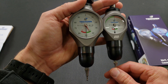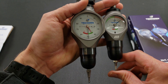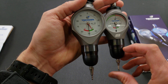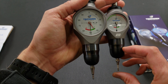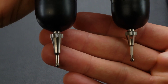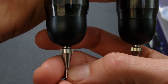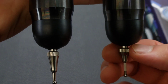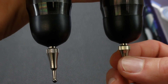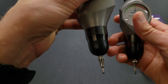It's pretty smooth in Z now — initially it was getting stuck right around a certain point, but it seems to have worked its way out. The V1 is even smoother in Z; this V1 feels like a good dial indicator, while this V2 feels damped — there's some damping going on. The tips are different too: this one looks like a ceramic shaft that's going to break easier without damaging the probe if you over-travel, while the other one just has a stainless shaft designed to bend and break at a certain point. This one also has a through-hole for tightening, which helps you replace the probe tip better — the V1 doesn't have that.